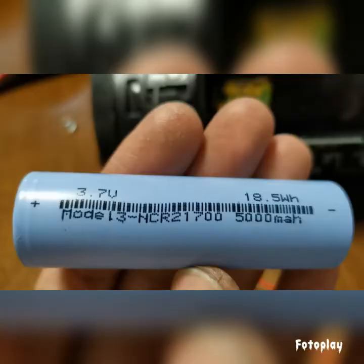Alright guys, that's it. So in summary, I used a 21700 lithium ion battery instead of the lithium polymer default battery. The original one again has a 6200 mAh and this one is 5000 mAh, which is a little less — it's probably not going to be 100% as powerful, but it's a tad lower and it does its job. We just need to make sure that it holds the charge and it also works. To put everything back together, just reverse the direction of what you did the first time. I hope this has been informative, please like and subscribe. Thank you.